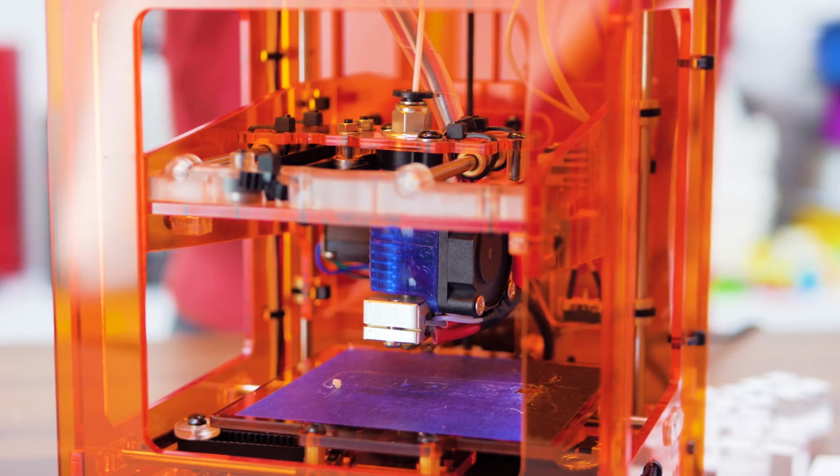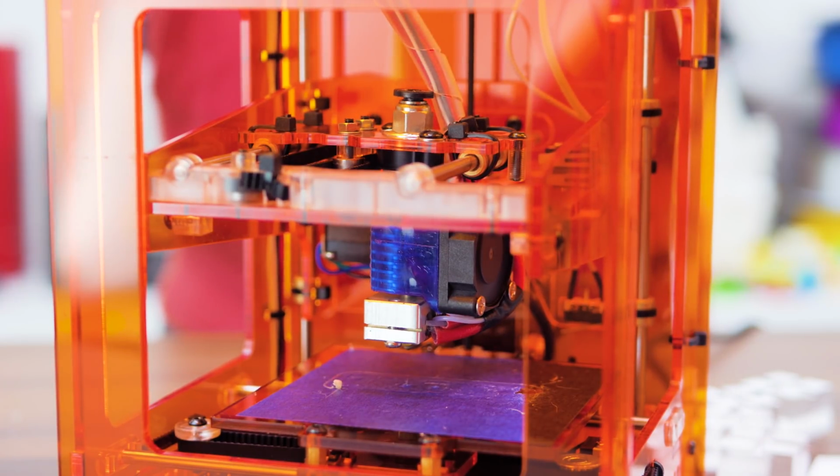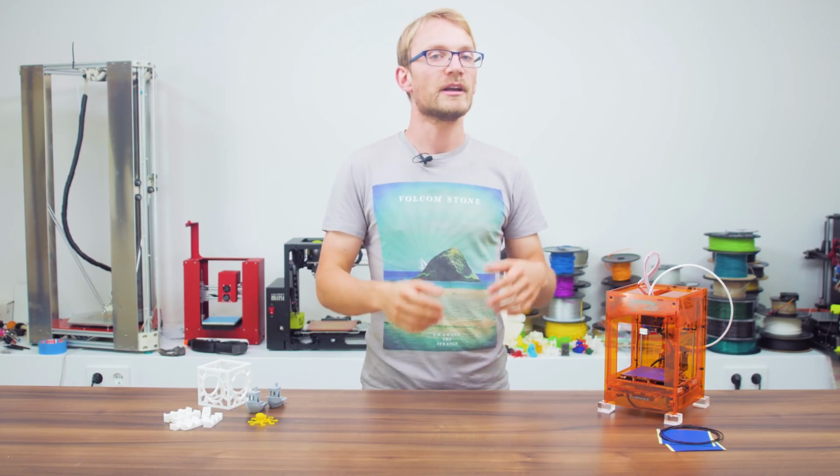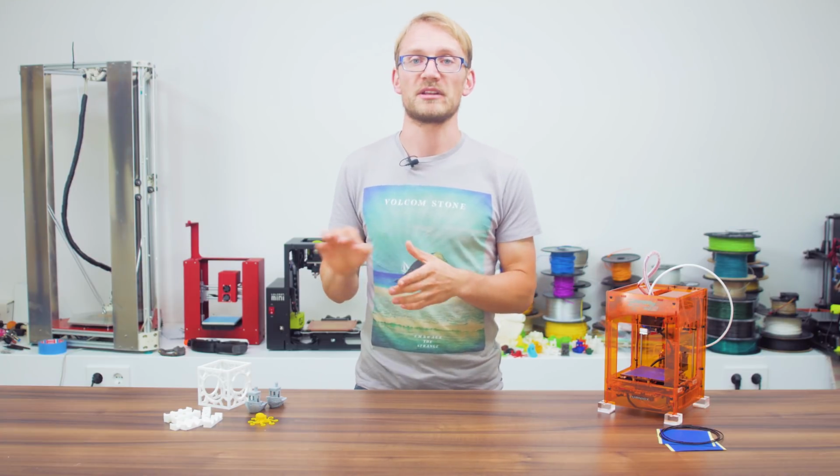What will happen is that the filament will stick to the warm but not hot metal sides and form a pretty solid plug, something the genuine E3D V6 avoids by having a thinner heat break that's not heating up the heatsink so far, and also by putting a bit extra effort into making the heat break smooth inside.